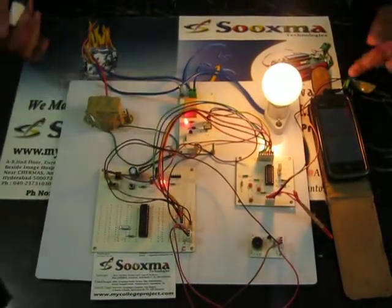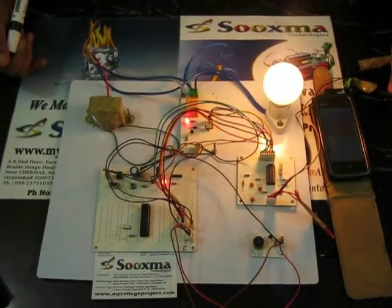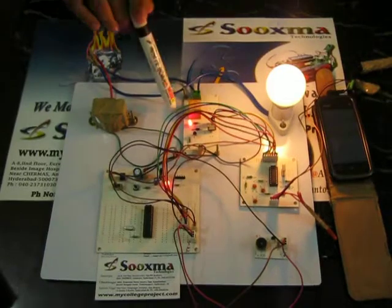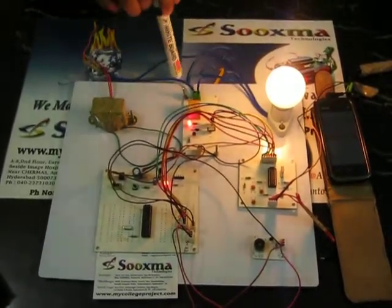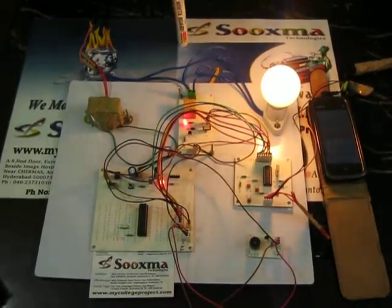As the device is on and the mobile is under auto-lift operation, you can even hear a voice indication as feedback that the device is in the on state. The relay switch can tolerate up to 7 amps of load at 12 volts, so you can easily operate any water pump interfaced to it.